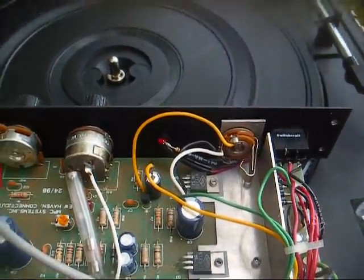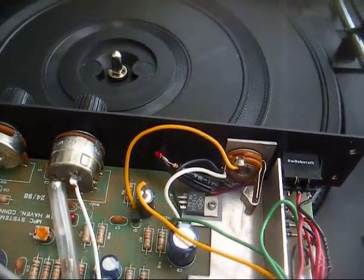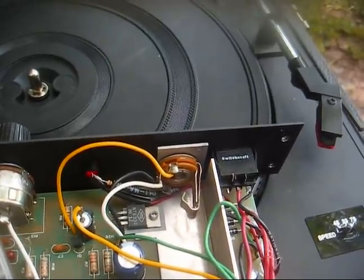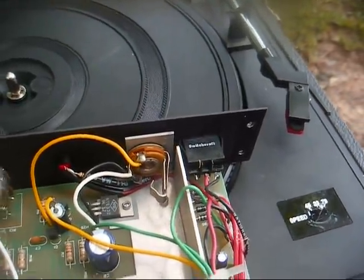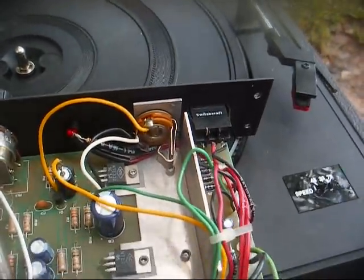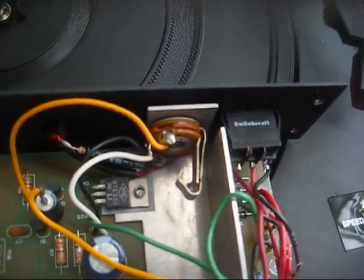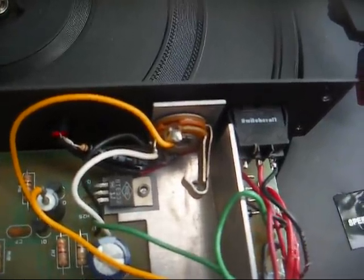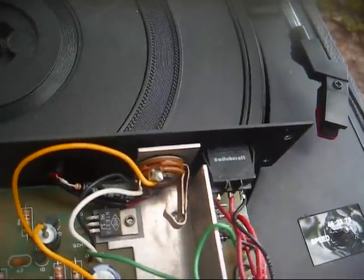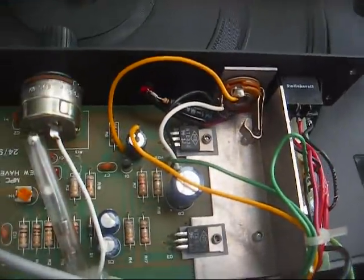Here's the amplifier, and this looks just like the amplifier that was used in some later Audiotronics and Telex — which Telex ended up buying Audiotronics. These classroom record players from the late 80s, early 90s. My suspicion is that whenever Telex got out of the classroom record player business, this MPC Systems, whoever that is, bought up all the excess amplifiers that Audiotronics slash Telex had and slapped them in these things. You can see the audio output transistors are riveted to the heat sink, and they are actually, surprisingly enough, NTE transistors — which is something you rarely see as original equipment. The NTE stuff is usually for replacement use, but I guess some manufacturers bought NTE transistors — they probably got a good deal on them.